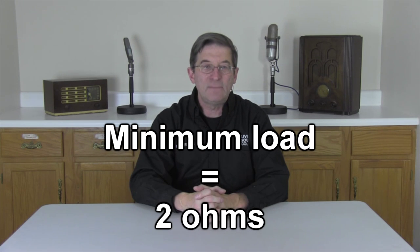But that doesn't go on forever, since the more power an amplifier provides, the more internal heat and stresses build up in its output transistors. So we need to take speaker impedance seriously, or we'll end up with a lot of dead amplifiers. Most manufacturers recommend a minimum load impedance of 2 ohms, which draws all of the power available from an amplifier. But in the pro sound world, we want our amps to last forever.